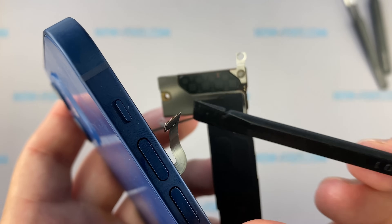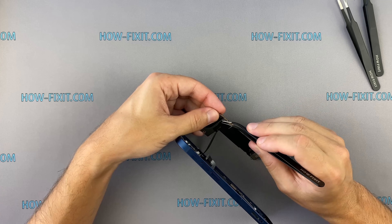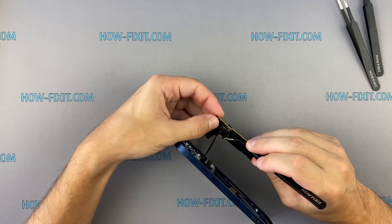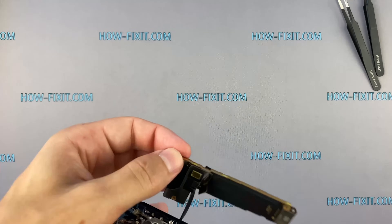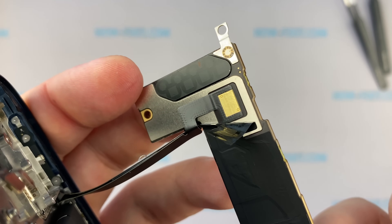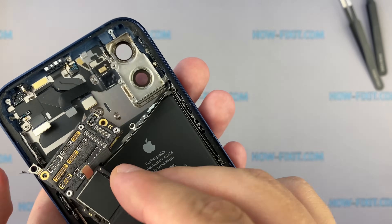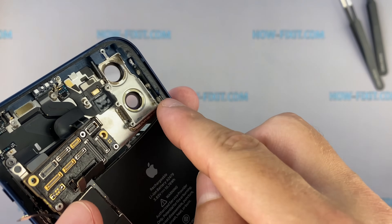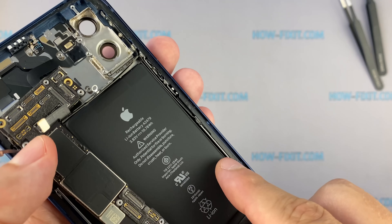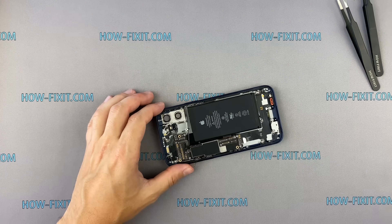This cable is connected to the back of the iPhone's motherboard. Now let's remove the film and see what is here. It can be seen that this cable is not just connected to the motherboard — I think this cable is soldered, but I will check it later. Now you need to remove all the screws on the case in order to remove this cable with the motherboard. But first you need to remove the battery.